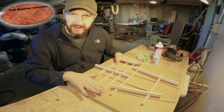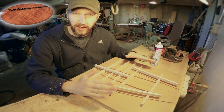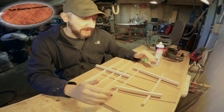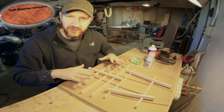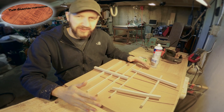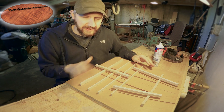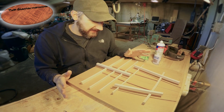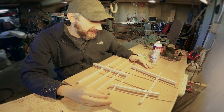This top surface that we're looking at is actually the part that gets glued to the top plate, so this is what's going to shape that top plate essentially. We'll do an adaptive strategy to hog out most of the extra material, and then use a 3D scallop to carve out everything — maybe a little bit of handwork — and then we're going to press that top right into these and glue them. Here we go, let's get started.